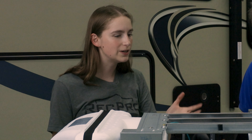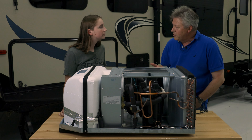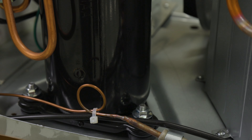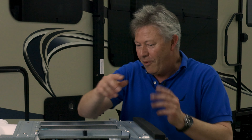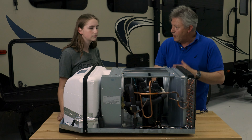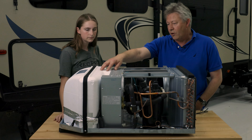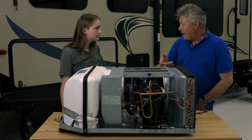So you mentioned that the AC is quiet — how does this AC achieve quieter decibels compared to competitors? There are two main sources of noise. The first one is from the compressor, and you can see that our compressor is loosely mounted — it's actually mounted on springs. If you just leave it on springs it'll wobble around, so we've got a retaining system in there to make sure it doesn't go too far. By putting it on springs, we're making sure that the noise from the compressor doesn't go to the base of the air conditioner and doesn't go into the roof of the van. The second source of noise is the fans, and we've put a lot of effort into making sure that the fans are operating in their most efficient band, so they're moving a lot of air but doing it quietly.